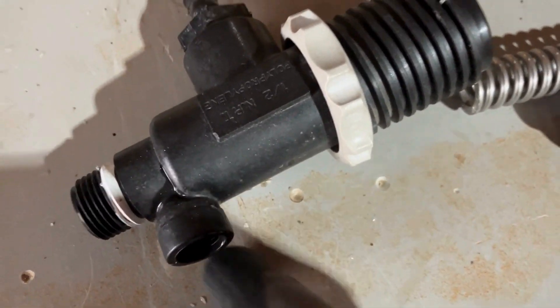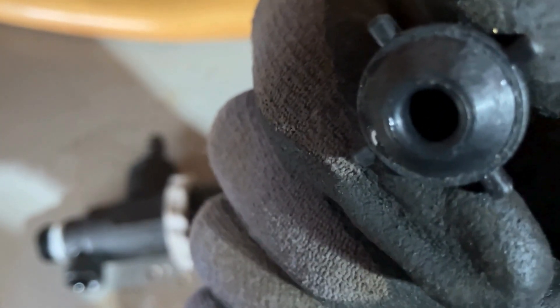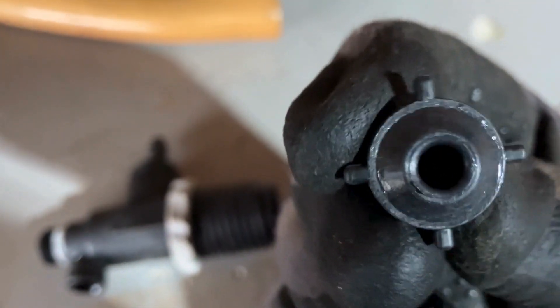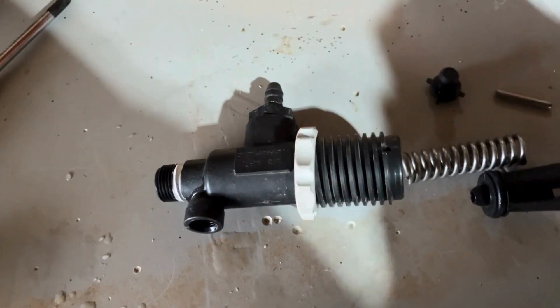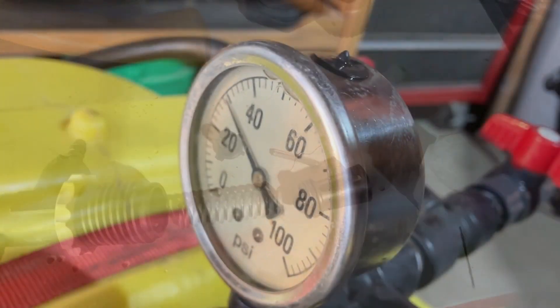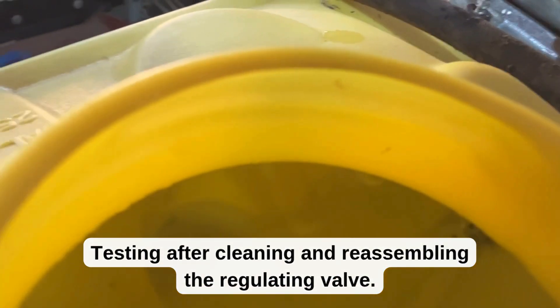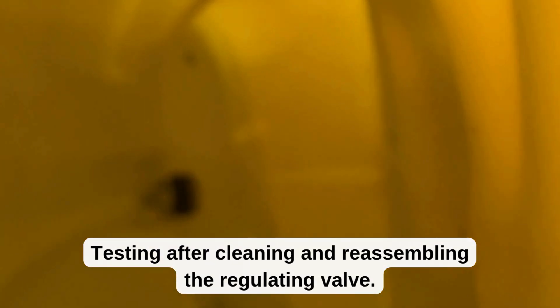As this opens to let water flow, it's going to bypass out here and through to our pressure gauge. It does not seem to be residue buildup here, no damage — looks like it's keeping its shape. I'm going to clean everything up and put it back together to see if we can get it to work. After cleaning, it's not cycling as quickly — it's happening a little bit slower — but I was only able to get it down to a little bit less of a drip. It's still not quite sealing up.